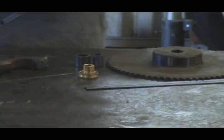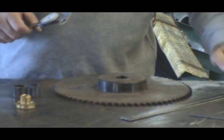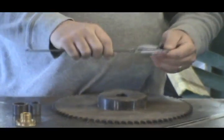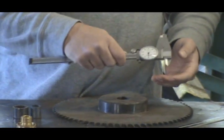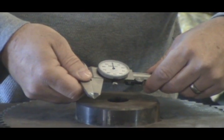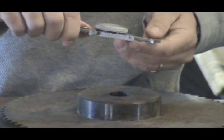So let's put it to practical use here. We've got this sprocket here and we're trying to get an idea of a diameter on the inside. The scale is a pain — you think you're right, but are you really? With calipers, all you have to do is bring them in here. Do you have to zero it first? Yeah, you do. You bring them down until they're touching and then they're zero. There are fine adjustments all over this — you can read the operator's manual. All we do is drag them out, push them forward so the teeth are touching, and make sure the zero is on zero.